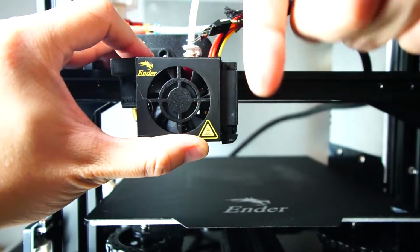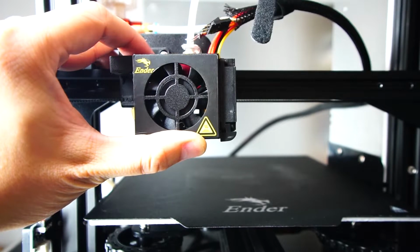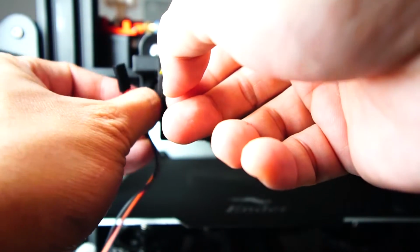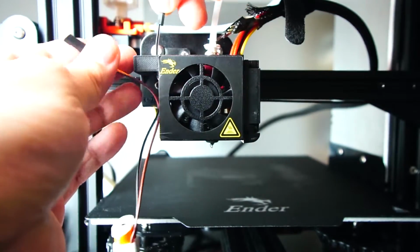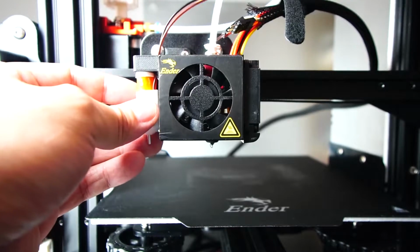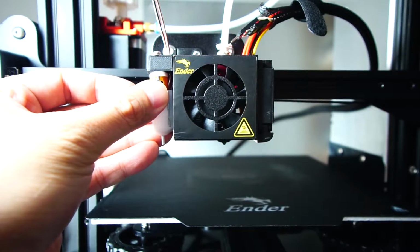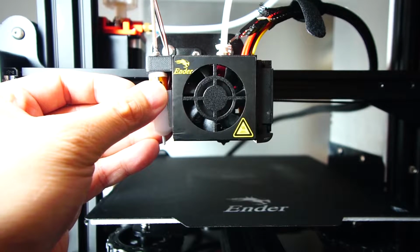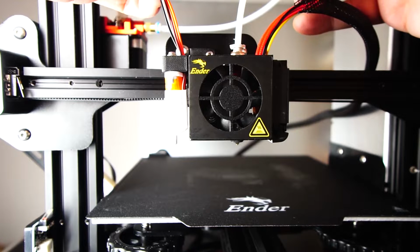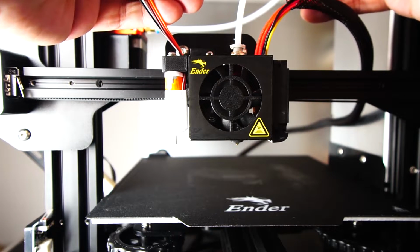Now it could be a little tricky because your fan case is not attached at this point, but just kind of hold it there, and once you get it all tied in, then next thing you do is grab your 3D Touch, and there should be a gap on the mount where the wire goes through, so you're just going to simply slide it through the mount. And then once you get both those wires in, the sensor just comes up, and there are 2 hole mounts on top where you just screw in and hold it in place. Left is for us to connect the connector points up on top after we screw in this bolt. So we just simply make sure we line up the wires properly, make sure that we're not accidentally putting in things backwards. Just make sure that the same colors are connected to each other, red to red, orange to orange, brown to brown, white to white, black to black.